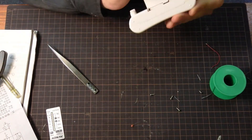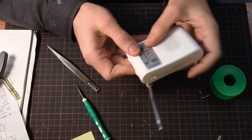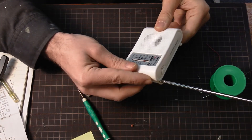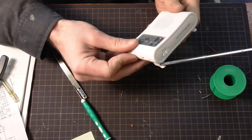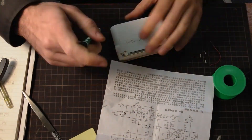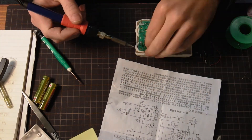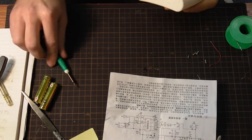Getting things together, trying to figure out how this case is gonna fit. It's a slightly poor fit — it seems like it snaps, but it doesn't really snap. And that's it, it's put together. Try it out — the light's on. But the problem is, you turn it on, you turn it off, and that little power light always stays on. But it doesn't always make sound — that just means the batteries are connected in slightly the wrong spot. So I'm going through it, looking, trying to figure out where the battery should be connected on the negative side. I discovered how the switch operates and I just had to move it one contact pad over. And now it works.